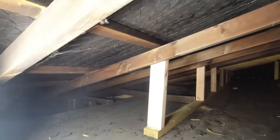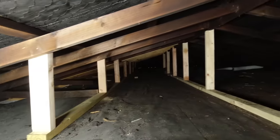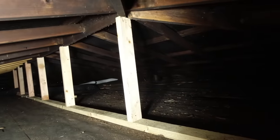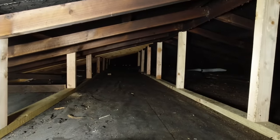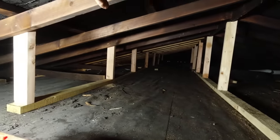That's looking a lot better. I did notice the ridge board was sagging down a bit, especially in the middle, so I just propped it up as I went along and it's nice and straight now — that definitely needed doing. All I need to do now is just put a few cross braces along there and that'll be plenty strong enough.